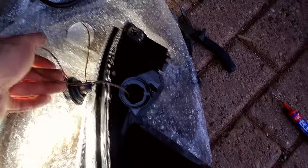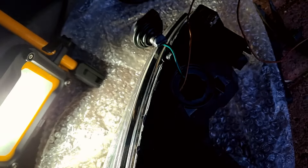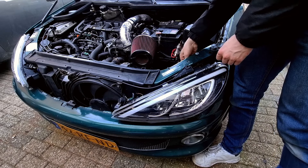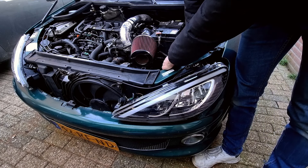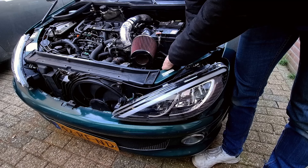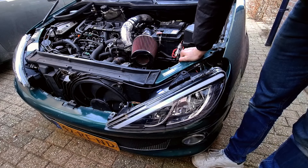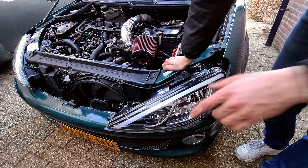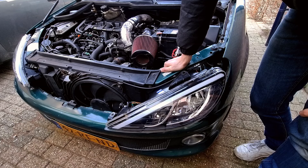So I've got the extra wire connected now — I think I soldered it well enough. Now we're gonna try to get out the module and then solder this wire to the module and hope it works. I've got it soldered now, so let's see if it works. Nope, still doesn't. Yeah, so it does work now! I was scared there for a second, but it only had a plus wire — it didn't have a ground. Okay, I don't know how long this thing is gonna hold up but I guess we'll see — time will tell. Problem solved.